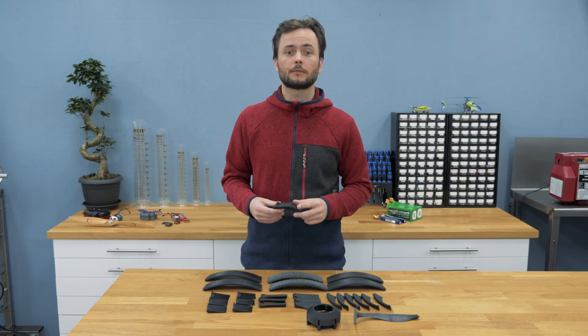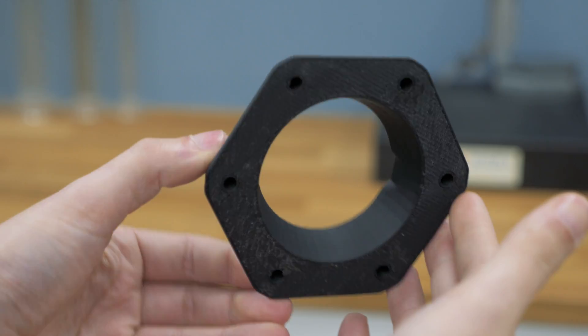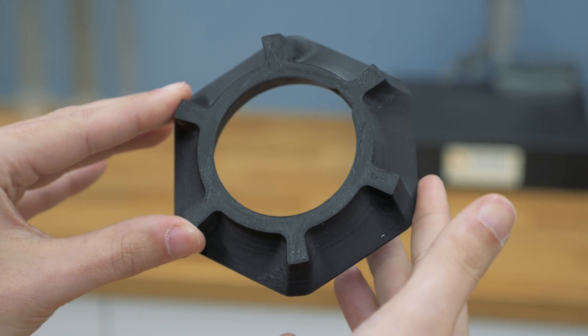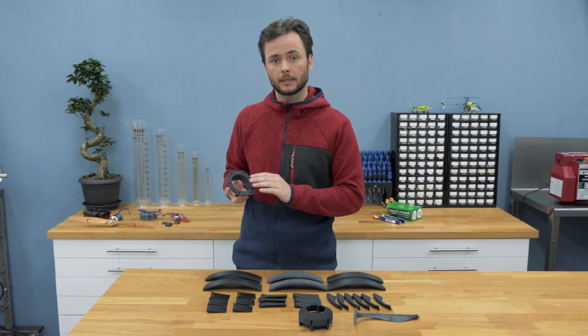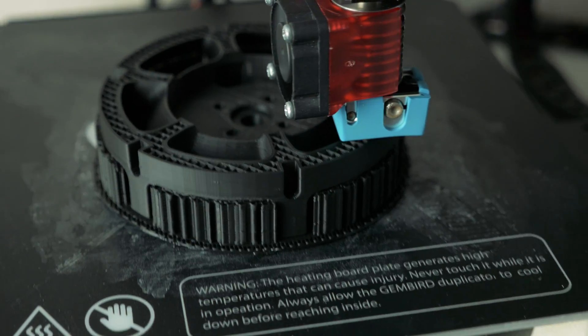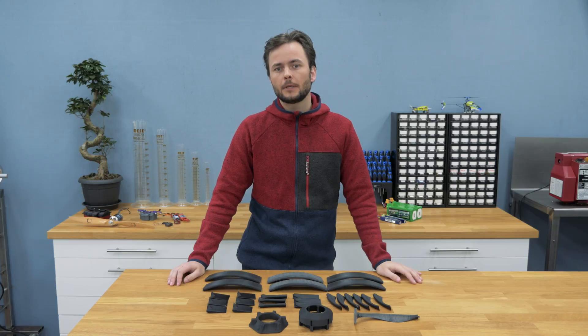And finally the last part that I made. I designed and made this adapter block after I finished the rest of the parts. I noticed that the motor mount has a pretty complex shape, so I decided to make this adapter. It transforms the complex shape to a much simpler hexagonal shape. The overall printing time for all the parts combined was roughly 55 hours, which is a lot more than I expected. This is mainly because I used very conservative printing speeds to compensate for the lack of rigidity in the printer's frame.